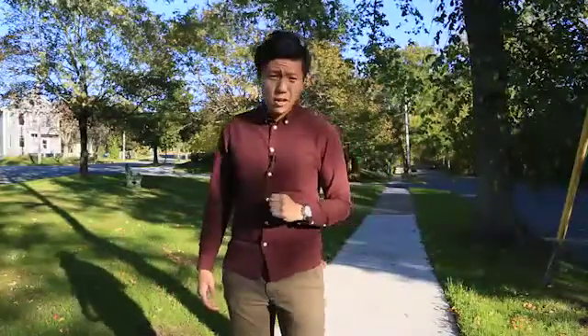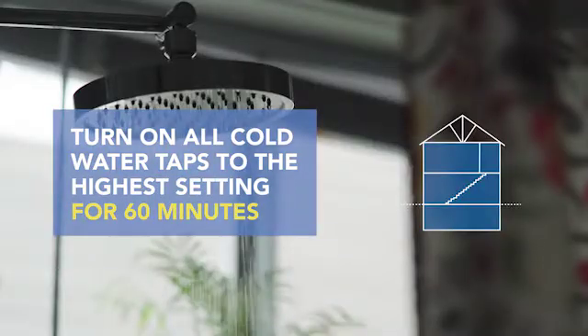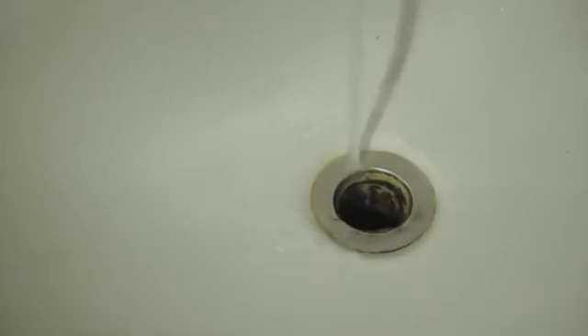Now there are some temporary safety precautions you want to take after you've replaced your lead pipes. Immediately after construction, turn on all your cold water taps to the highest settings, working your way from the lowest level to the highest level in your house. Do this for approximately 60 minutes to remove any lead particles or sediment that might have become dislodged during construction. This might seem excessive but it's much better to be safe than sorry.